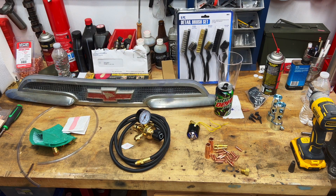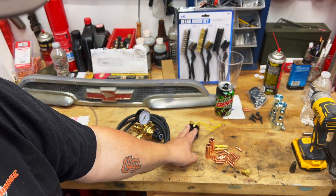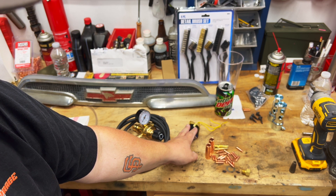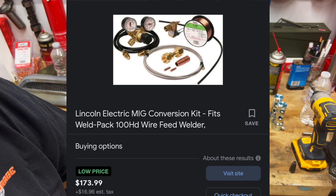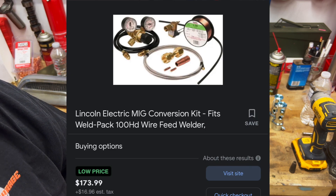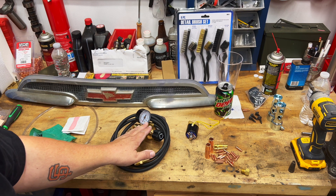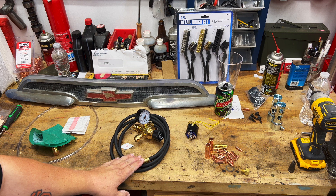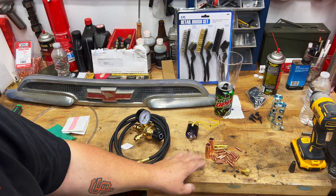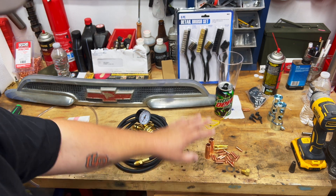Let's talk about the parts needed for this conversion. One of the biggest parts on the welder side is this solenoid. It will mount inside the welder towards the back. The Lincoln kit is about $200 roughly, give or take depending on where you buy it. It comes with a solenoid, a regulator, a hose, some hardware pieces, and maybe the nozzles. I parted it all out.